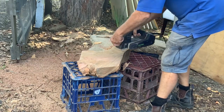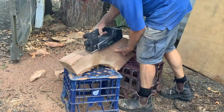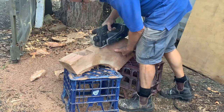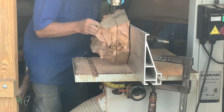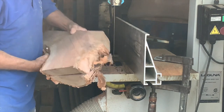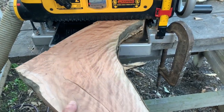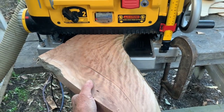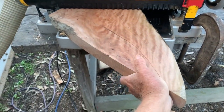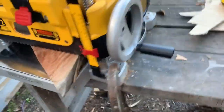From my stock of big chunks felled years ago, I planed a flat on two sides, then cut them over thick on the big bandsaw, and ran them through the thickness planer. I had exactly enough blanks to make all of the knees that will be visible inside the cabin from tea tree, and they will all be varnished.